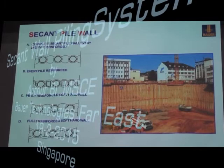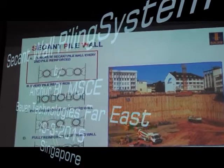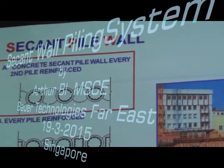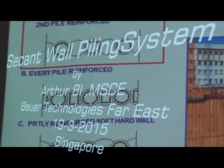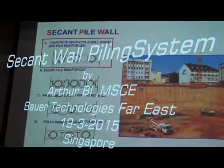It means not every Secant pile is reinforced, and the primary piles are just concrete. You can either use weak concrete or use structural concrete. In a very special case, every pile is reinforced. Or use some other system to have big primary piles, or we install the piles with I-beam instead of cages. But again, type A is most popular in the market.